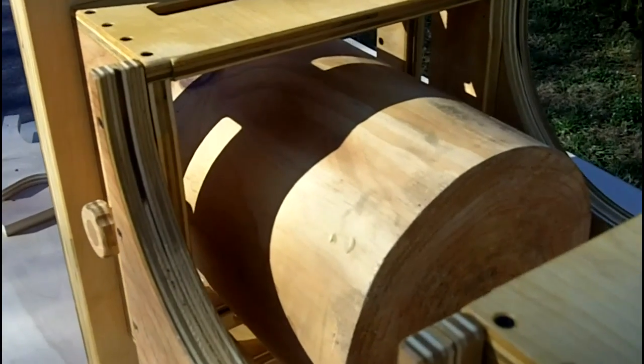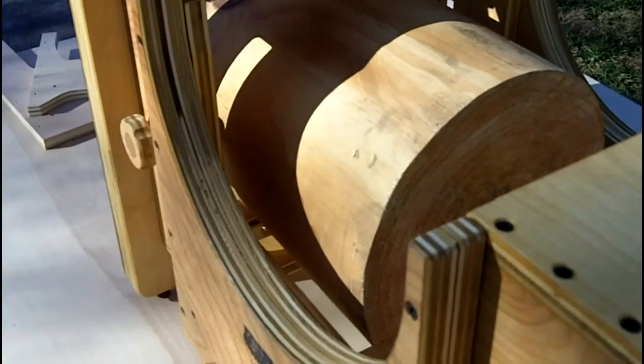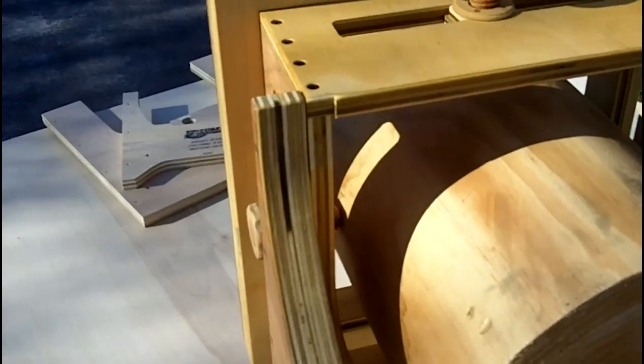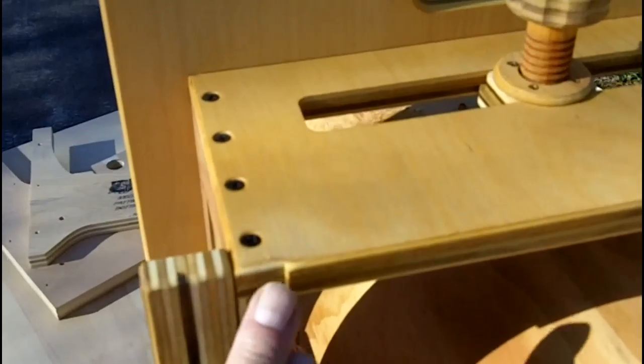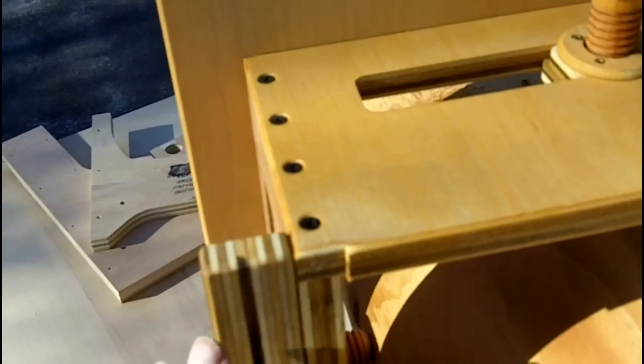Out of the 3 sizes of dovetail jigs, I don't think I've done any larger than a 12 by 12, although I can do a 14 square or 16 square. This was one of the second jigs that I've ever had to actually go back in and trim a little bit on the standard jig, simply because the pattern they wanted, the log is oversized. Their 12-inch large log is actually larger than 12 inches. So this opening had to be even larger yet to accommodate the chainsaw attachment, which is a 1/4 inch off of the jig. The cutting path changes a 1/4 inch off your patterns.